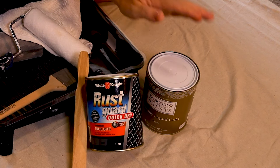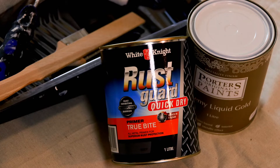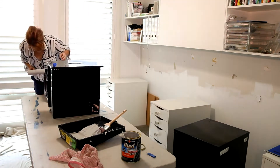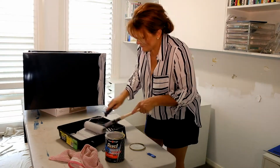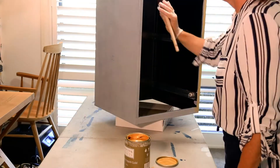The team at Bristol recommended this system to me. I went to them and said I want a metallic gold finish, and so they've given me these two products to use together. The top coat is actually from Porter's Paints — it's the Alchemy Liquid Gold. Both products are water wash-up. The Alchemy Liquid Gold is touch dry in 20 minutes, which is amazing, and you can recoat after an hour. Always remember that your environment affects drying time — whether it's colder, wetter, hotter, or drier.